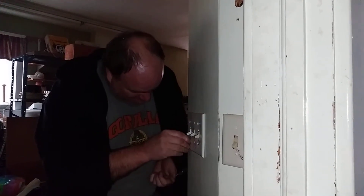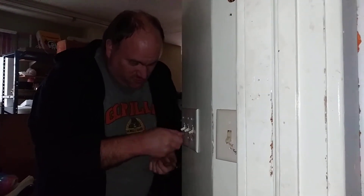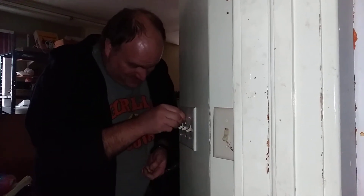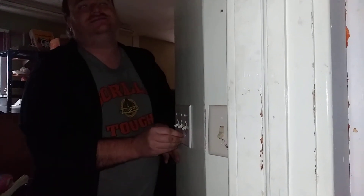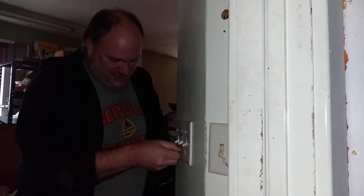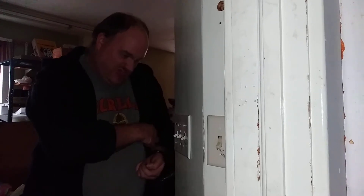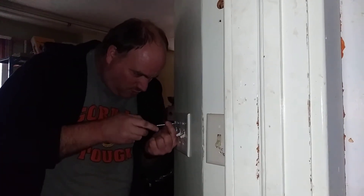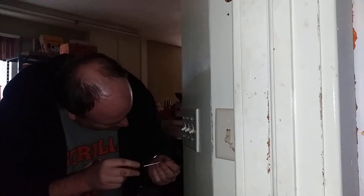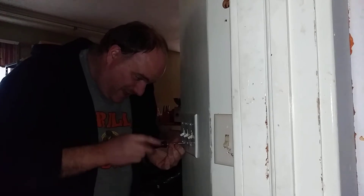So it wasn't something we screwed up? No — the switch got switched off, shorted out, and kept blowing the breaker. That's what it was, so now it's been disconnected. Was it that junction box? No, it wasn't — nothing close. We had the wrong wire when we followed it. And there's a nice green light in there to let me know the GFI breaker is working, so I know we got power.